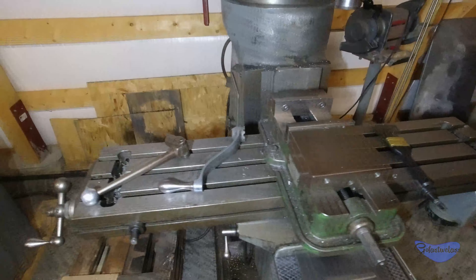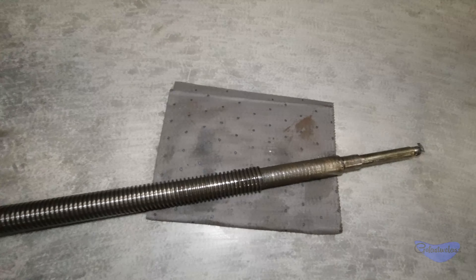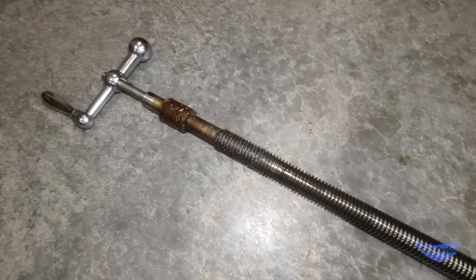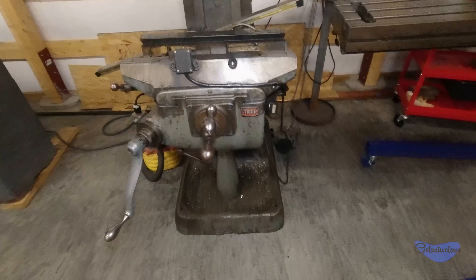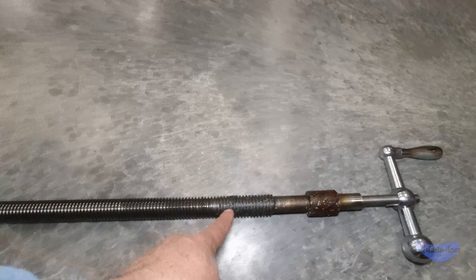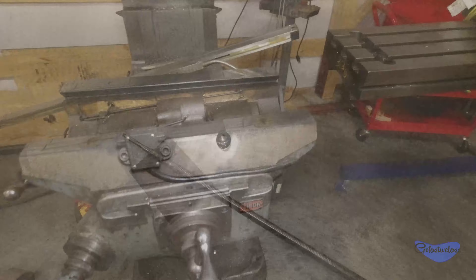I've been making chips. Take a look at the lead screw here — for the most part it looks really good, but it's covered in a lot of crud in some spots. It's clean in the middle and then covered with crud over here; this area is completely gummed up. It wasn't loose, but it would get tight on the ends, and now I know why — the parts where it got tight are exactly where it's gummed up. It would literally just stop.